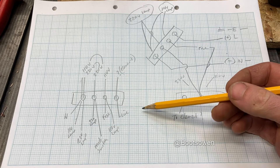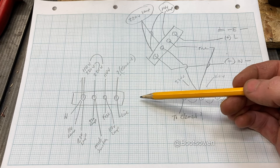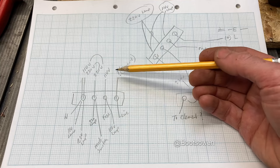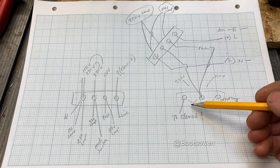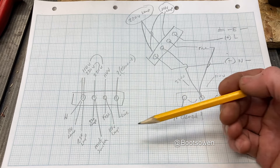So with the fuse in and the switch on the 110 volt side, it's connecting these two fellows. If it's pointing over to 220 it's connecting these two - when it says 220V it's really doing nothing, and when it says 110V it's joining up this side. So maybe someone had hotwired it - that's my thinking - to put both elements on the one loop, and that makes sense because both lights were coming on when the fuse was in.